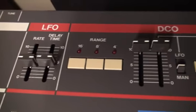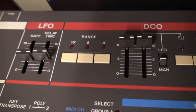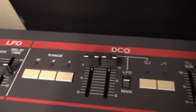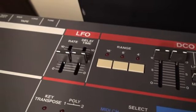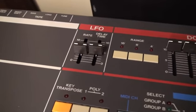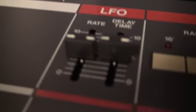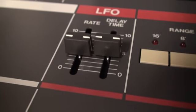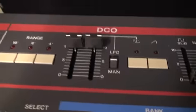Here's an update on the Technology Transplant fader caps. You've got to be really careful with them because they actually don't quite fit on the square shafts. They're basically complete duplicates of the original Juno cap, which was made for a tapered fader and not the square one supplied by Technology Transplant. If you look really closely here, you'll see the plastic actually stressed out and turned white at that point.